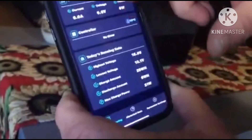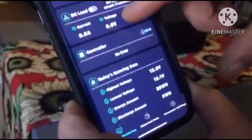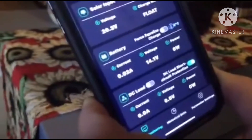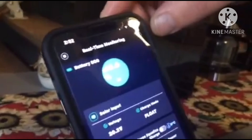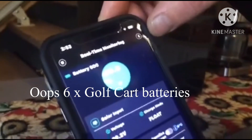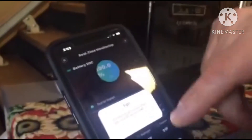It shows some other features, like how many watt-hours have been put in — it doesn't put much in when I'm not using them. I have a total of 600 watts out there and three golf cart batteries. It does pretty good — you can keep some basic things running in the house when the power goes out.